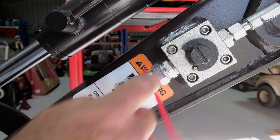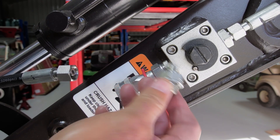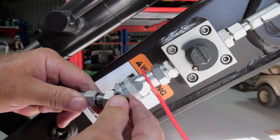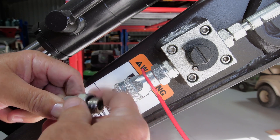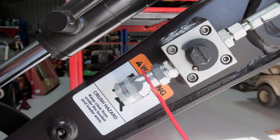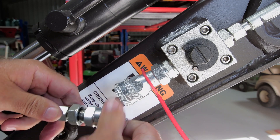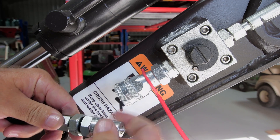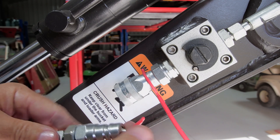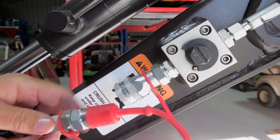So we've got that sorted now for the valve body. If we go back to our hose — that's our hose there — so I'm going to now reuse this one that came out of the block here and put the metric to the metric side here. This seals by a rubber o-ring that's in there, so that's a different sort of system that fits inside, and then we put this on. Once that's on, that thread there is the same 3/8 BSPP that we've put in here. So then you can get the male connector and that just goes on the top there, screws in the same way — there's a rubber seal there, it goes all the way down to the seal, and then it tightens and that's on the pipe. And the same — we can put a rubber dust cap on there so when we're not using it we can push the rubber cap on and that stops dirt getting onto the end of our connection.